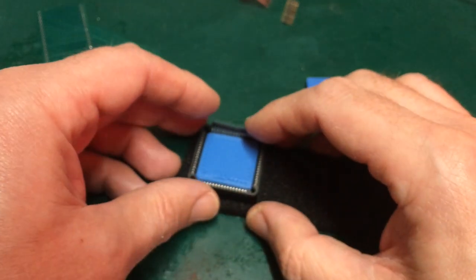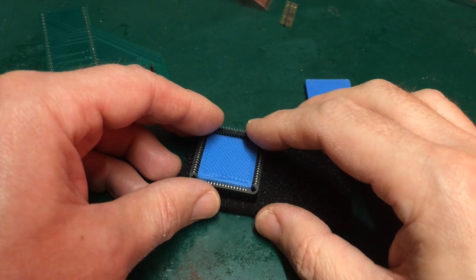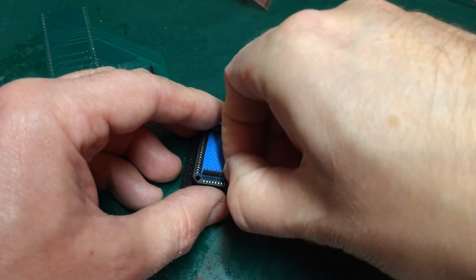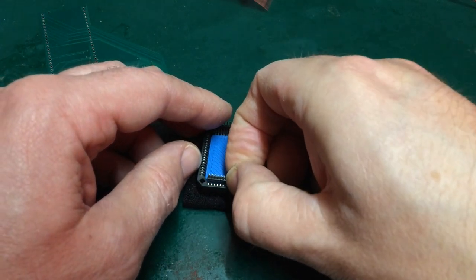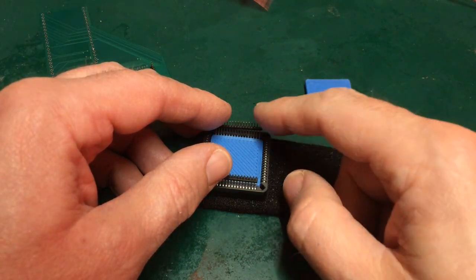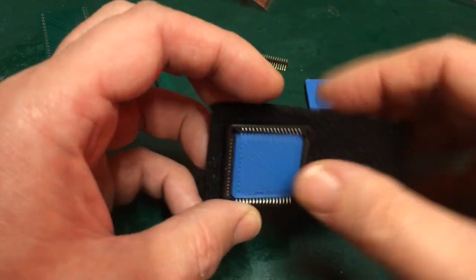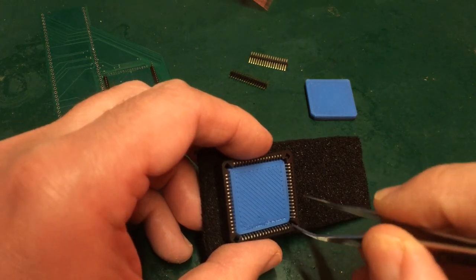So here, for example, that would make a very snug fit on that side. Possibly too snug. If I got those pins in, which I suspect they would, because there's a degree of spring in the socket, I'm not sure they'd come out without causing damage. So I think we can conclude that a snugly fitting plug is not the way to go.